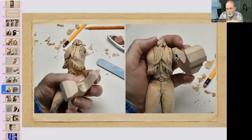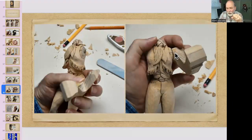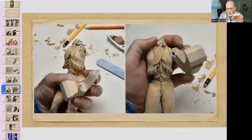I then brought it over here, and I made a line that would show me exactly where that arm had to be tilted up so that this hand ended up on the fiddle. And so every time now that I put this arm onto the dowel, it wasn't going anywhere. It wasn't going up, down, forward, or back, because it's tight on the dowel. If I lined those two lines up, I knew that's exactly where I wanted to trim material off so it would fit perfectly, and I'd reduce that gap you see there to 0.